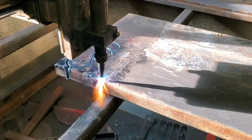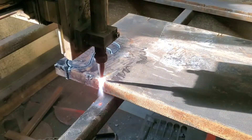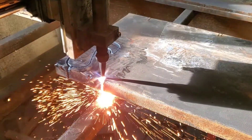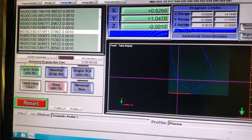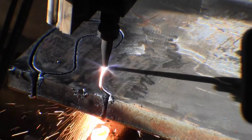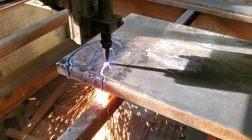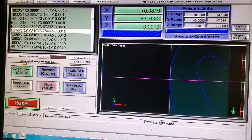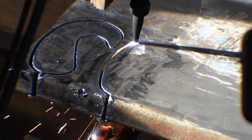Not shown on camera, I'm about to hit start on the computer and just before I do that I'm going to manually turn on the torch by hand. Today I'm cutting with a number two tip at roughly 11 inches a minute. Before I started cutting I let it run a pre-cycle over top at normal speed without cutting, just to preheat the metal.